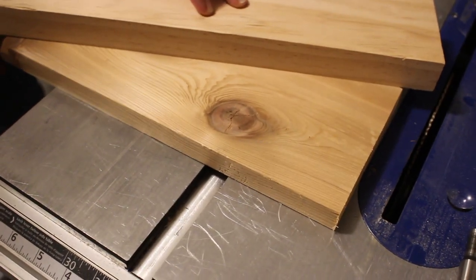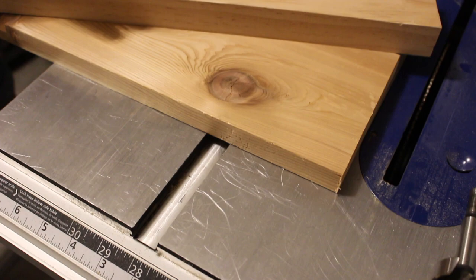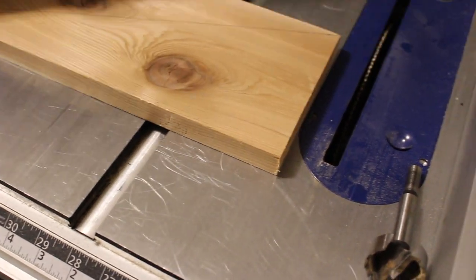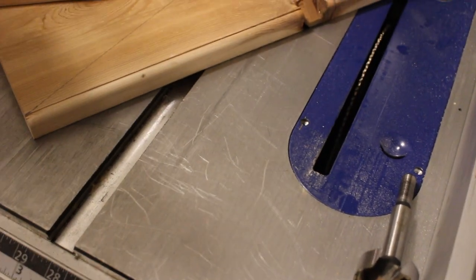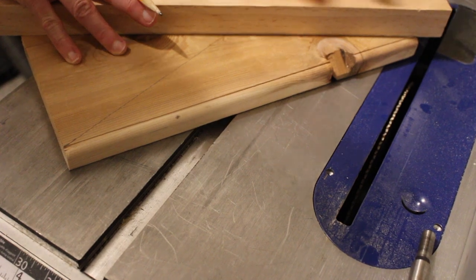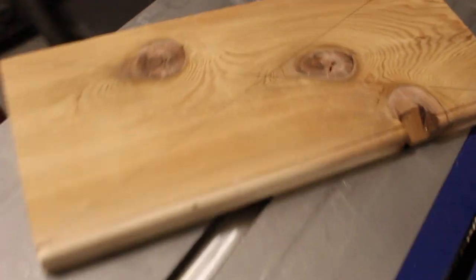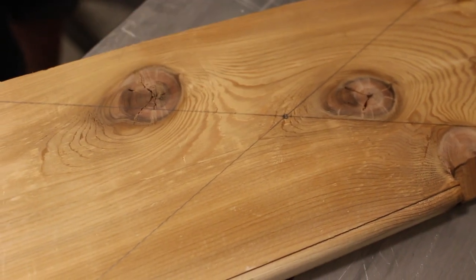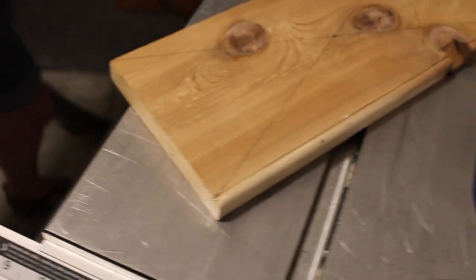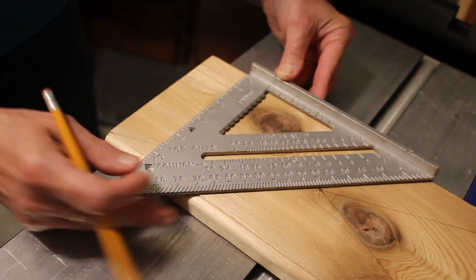High-tech here — we're using another board as a straight edge. We spare no expense for high-tech equipment on this channel. The best way to find center is to draw diagonals between the two pairs of opposite corners, and where the two lines meet in an X is the absolute perfect center of this board. You don't have to have a lot of equipment. Here is our center, and now we're going to make the opening for the bottle neck — the good bottleneck, not the bad one. Now we need to find the middle of the board for the appropriate openings for our glasses.